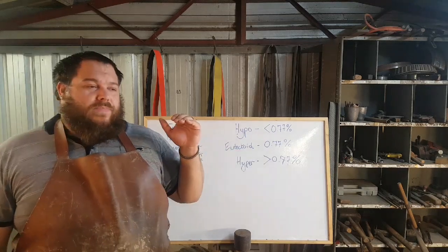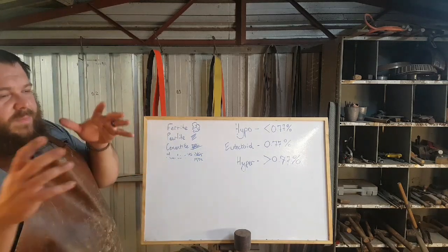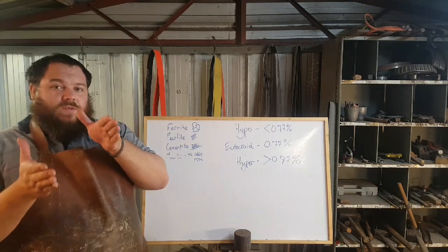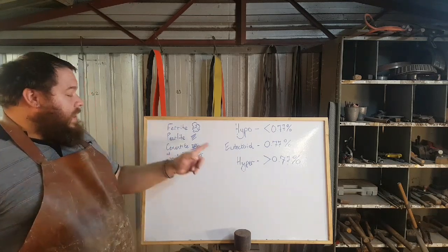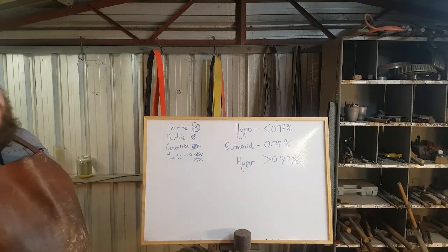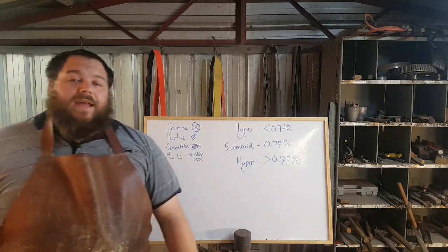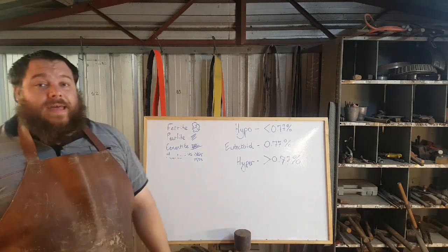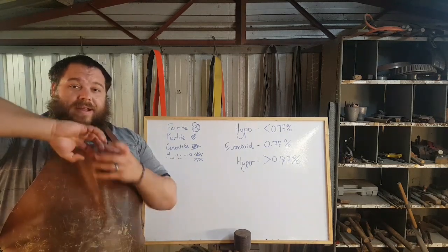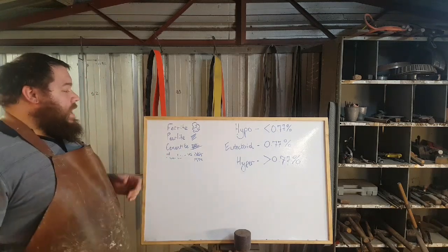cementite layer. So you've hit a boundary between two grains because maybe you've overheated the steel when you've done your normalization. You've hit a boundary that is quite large that's made purely out of this nice hard brittle cementite, and you're never going to get through it with a standard drill bit because this stuff is as hard as hardened martensite. And also carbide clusters are why you end up snapping drill bits. It's because you go through a nice piece and as the drill bit comes around it hits that carbide cluster and just stops, and bang, there goes your drill bit.